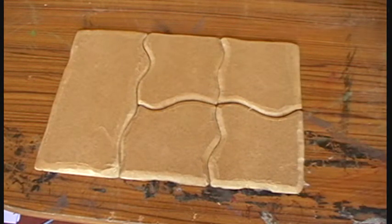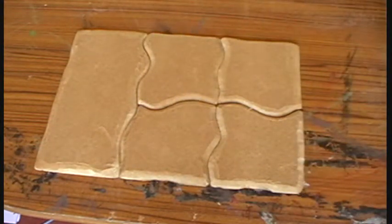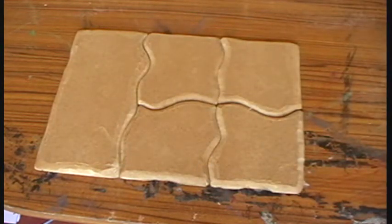I actually collected up my sawdust left over — it's quite handy for bulking out things like polyfilla, or you can mix it with PVA glue to make a basic filler to fill up gaps. So keep a supply of sawdust — it comes in handy sometimes. What I'm going to do now is break the rest of the process into stages and walk you through each step one at a time.